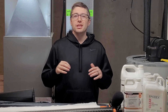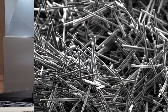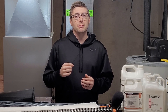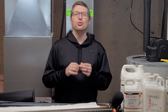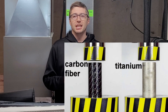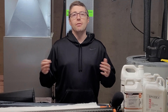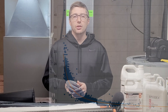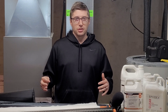So what is carbon fiber? It's a bunch of ultra-tiny microscopic fibers predominantly made of carbon atoms. These things are very small, but when you combine them together they can be stronger than steel. You could think of it as a high-tech fabric, similar to cotton or polyester in your clothes, but when used in the right way it can be extremely strong, extremely stiff, and even stronger than steel when looking at the strength-to-weight ratio. Shaving weight is the biggest thing for me because my application is automotive — shaving weight and gaining strength are some of the greatest things you can have when building a race car.